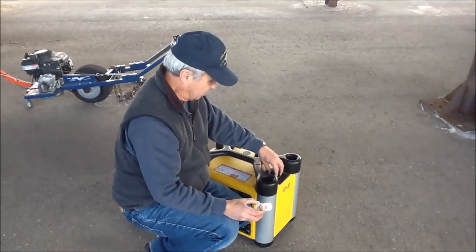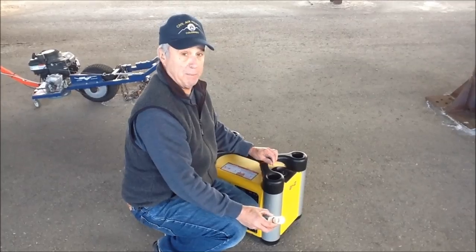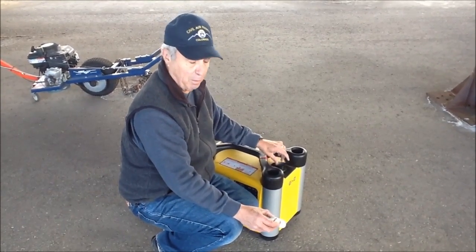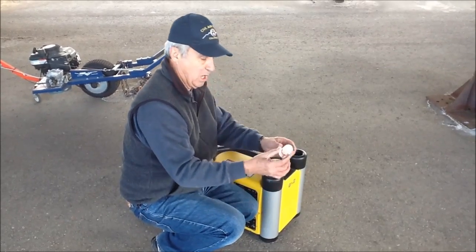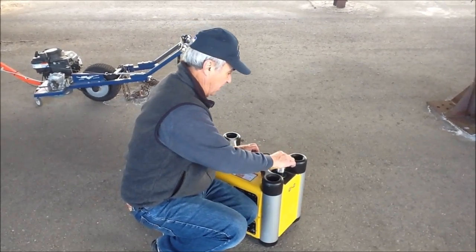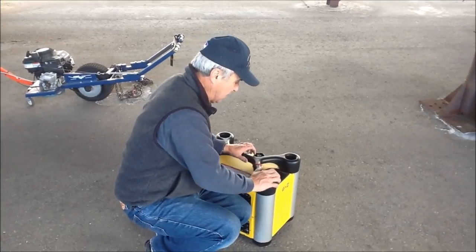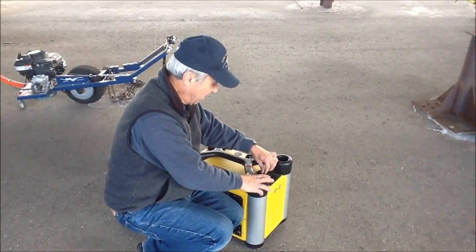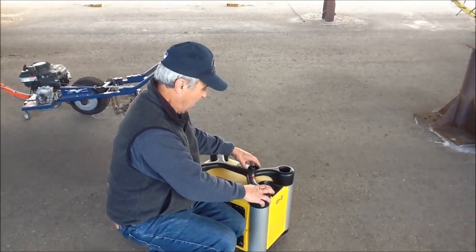The fueling of the generator, we normally just keep it topped off by using what we drain out of the sumps of the airplane. Rather than putting it back in the airplane, we put it in the generator. A small filter cartridge resides inside at all times. About the only way you see it's full is to look in and see the fuel level. It's down right now, so we'll put some more fuel in it.